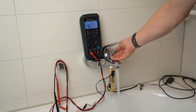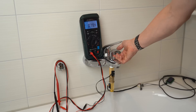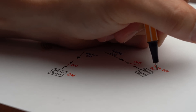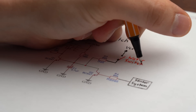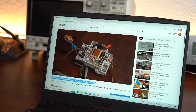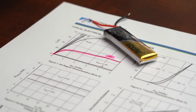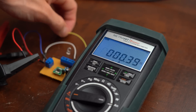All this tube does is electrically connect its two output wires to one another when water is flowing, meaning it is just a water-activated switch. It is mandatory because with it I can turn on the microcontroller system when I am actually showering and then automatically let it turn off by itself with a delay as soon as no more water is flowing. To achieve that I needed an additional SR reset latch circuit, so after building one up on a piece of perfboard — using a logic level P-channel MOSFET since it needs to work even with a low battery voltage — it draws absolutely no current when the circuit is turned off.